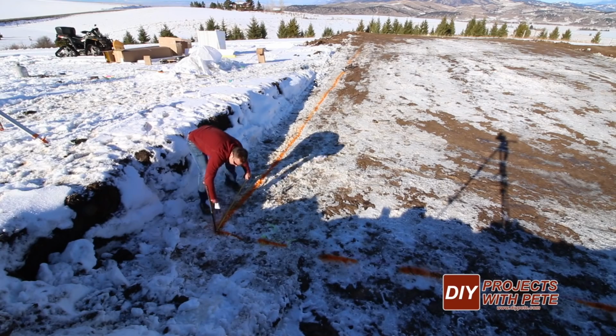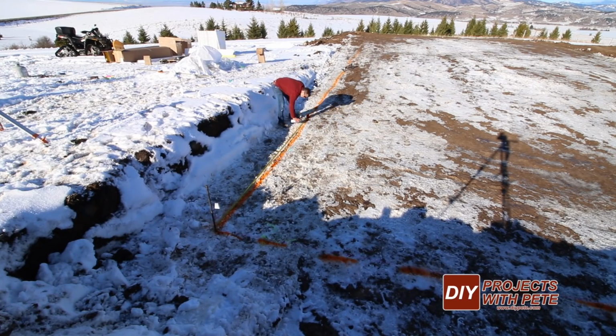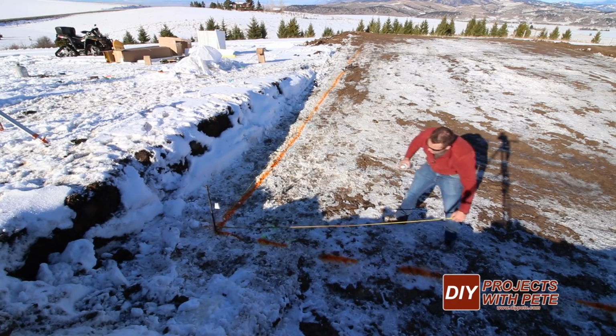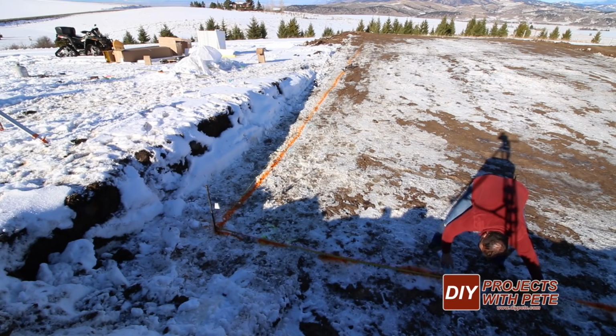If your rink is going to have rounded corners, you'll want to measure and mark in from each corner to determine where you'll start the boards for each rounded corner. I'm going to be using 4-foot wide by 18-inch tall high-impact plastic boards for this rink, and the 4-foot segments make it easy to create the corners.